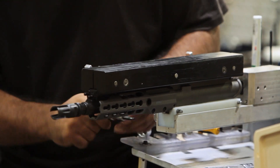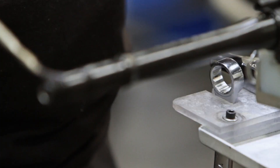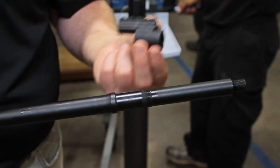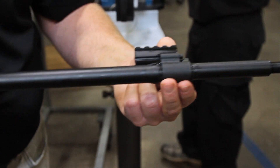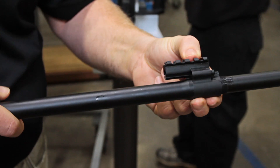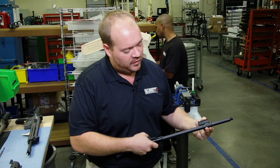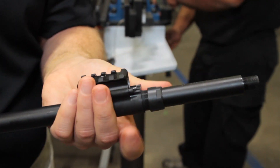You can clean it off of the rifle if it needed to be submerged in a solvent to clean out the cylinder. You can also inspect the gas port on the barrel and on the gas block. The gas block is retained onto the barrel on this surface, and there's an indexing notch on the barrel and a tab on the gas block so it cannot be installed in the incorrect index. It always lines back up top dead center, then the nut simply holds it back in place.